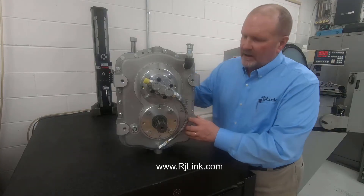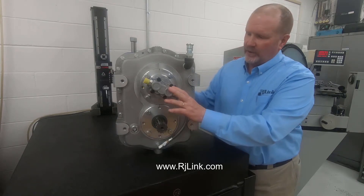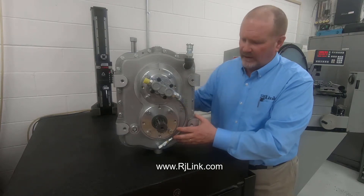In this design it comes standard with a recirculation loop pump. This pump is actuated through the input drive and it keeps the bearings lubricated in the upper and lower sections, so it constantly recirculates — and that contributes to the cooling factor.